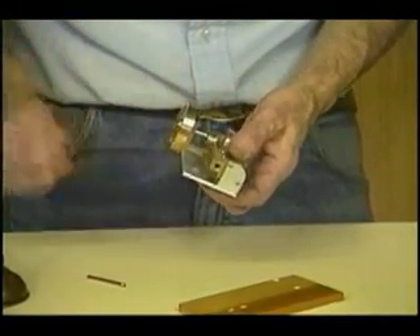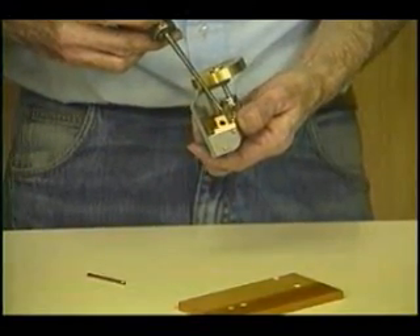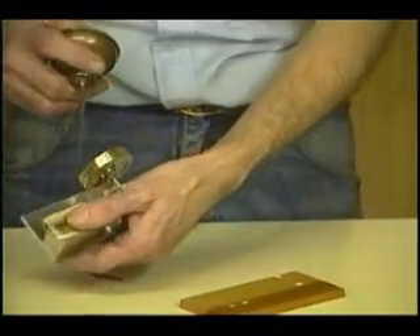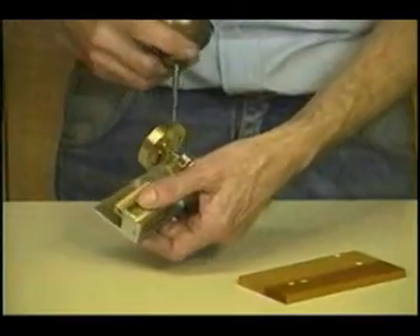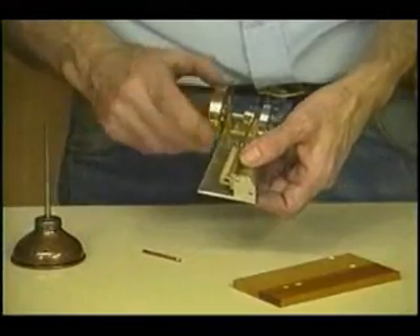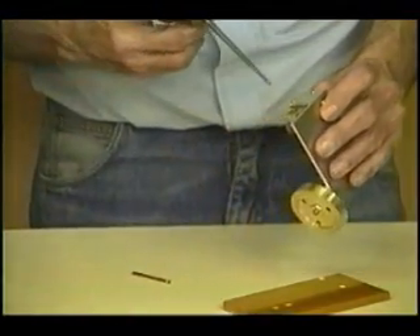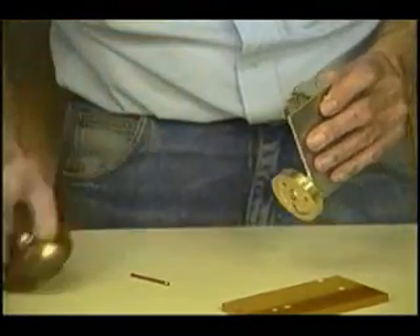You can hear it's getting sweeter all the time. Sounding very good. Now, there's no reason why you couldn't put just a little oil here at the base of the valve and a little bit here where the skirt of the piston comes out through the cylinder, because that will work under both the valve and the piston. It would also pay to put just a tiny bit of oil in the exhaust, because that will work back into the valve too.